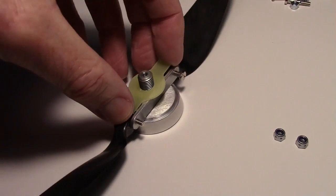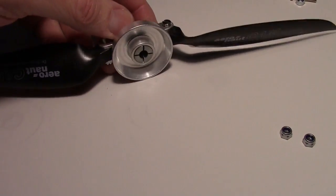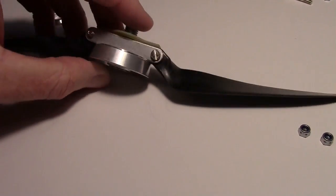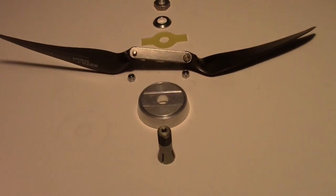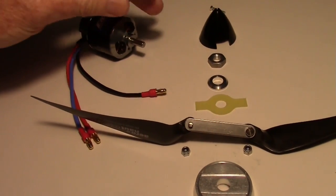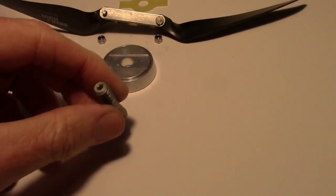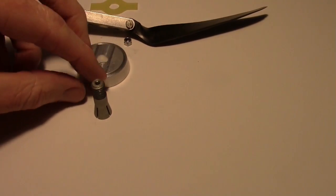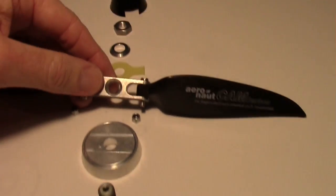You can see how it went together: blade stopper on top, yoke underneath, blades attached to the yoke with bolts, and that whole assembly fits into the socket on the main body of the spinner. Here's the exploded view: the piece that goes on the motor shaft — this is for the 5 millimeter shaft — goes onto the motor, and when the nut tightens down it clamps onto the shaft. The base of the spinner has a socket that clamps it on the shaft, with a trough for the yoke to fit into.